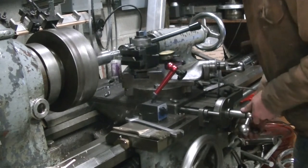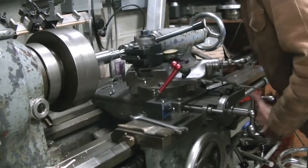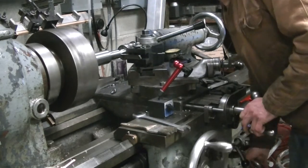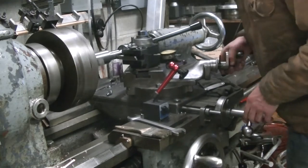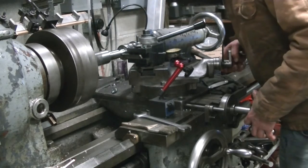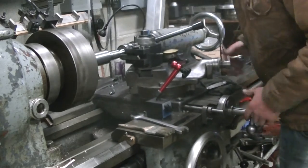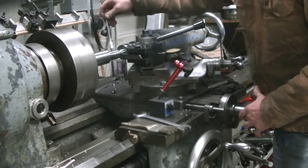The reason I wanted to put this video up is I've noticed a few people lately have had lathes with a reversing lead screw. Keith Rucker comes to mind — some of the new lathes he's got appear to me to have a reversing lead screw. The threading style is a little bit different than on traditional lathes where you disengage and engage the half nuts. For short threads, like the one I'm cutting here on this spindle nose, the reversing lead screw is really quick. I suspect on long threads it would be quicker to disengage the half nuts and crank the carriage back by hand, but on shorter threads, like I typically do, the reversing lead screw makes it go really quick.